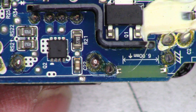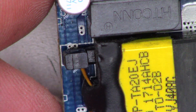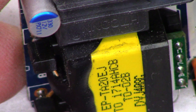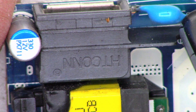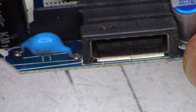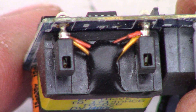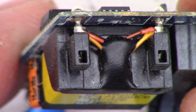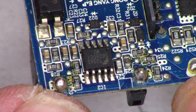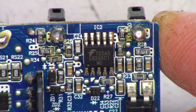Spark gap right there — 6 millimeters. Well, it doesn't look like it's too terribly badly designed. There's the output filter, 330 at 12 volts. A lot of shielding, or at least plastic, to keep arcs at bay. HTCON is the manufacturer of the plastic USB connector it looks like. Doesn't look too terribly badly designed other than that fuse where it solders in. Double wound secondary it looks like right there. I'm wondering if this IC has the rectification, or at least filtering, built into it.